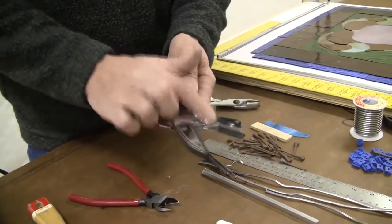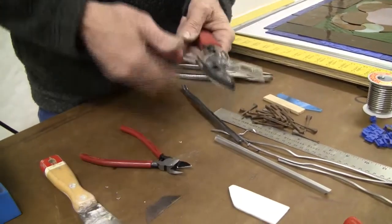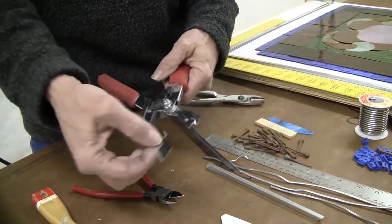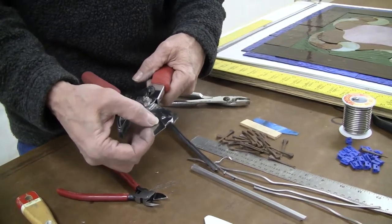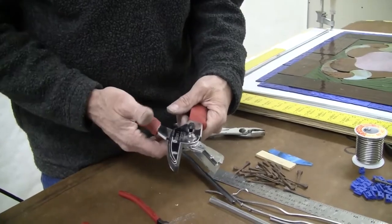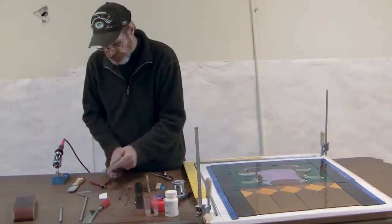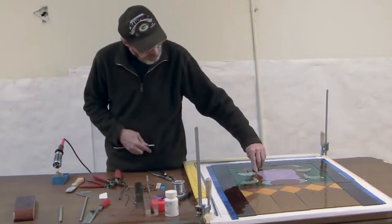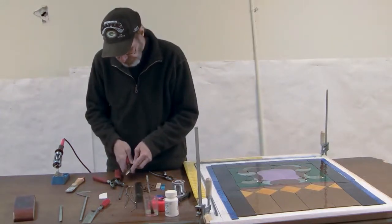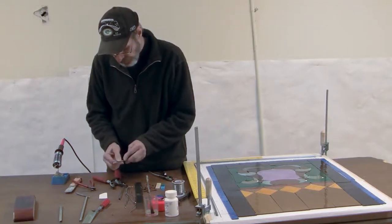It takes no tools to change the blade. It takes a regular utility knife blade. You pull the handles apart, pull out the blade. I tend to flip it around. I use the front of it quite often and get the full use of the blade by turning it around. And then you can use the front or the backside, and you just squeeze it together and lock it in place. Now, if you were going to tie two pieces together where you got a sharp point here, this tool will not work for that. You can only do so much, and the problem is that you'll bend the edging here of where you cut it.